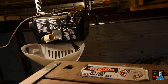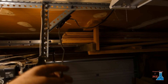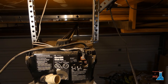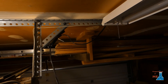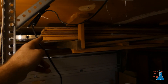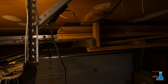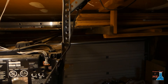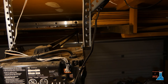One other thing I want to mention is when you're wiring this, make sure that you run the cable away from the track or anything that moves on the garage door opener. I have secured the cable, which you can see here, with a zip tie to the framework that holds the garage door opener to the ceiling. Then I'm routing it around the back so there's no possibility of it getting tangled in the mechanics of the garage door.